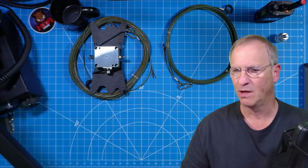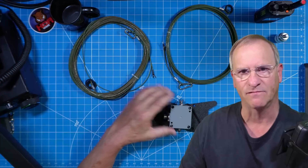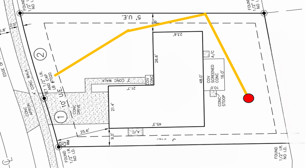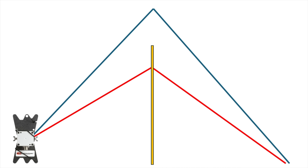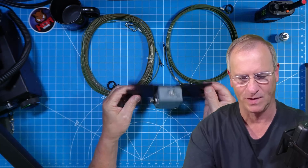So what am I going to do differently? Going inverted V would require enough space to get this 73-foot radiating wire extended across my property. You may have seen me do this with the LEFS 8010, where I had to get really creative with the configuration. That was a successful deployment. When we think about an inverted V, we think up-down — my radiator goes in an upside-down V, with the matching unit on one side, the wire going up to my portamast and back down. I'm going to do a sloping inverted V by attaching this to my home.